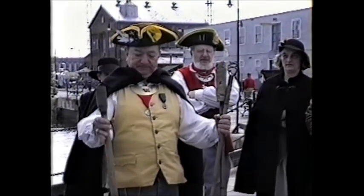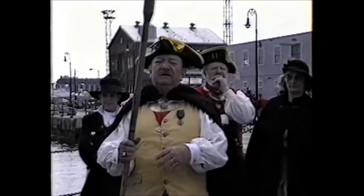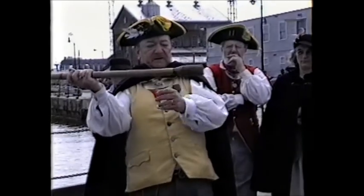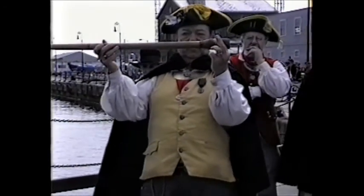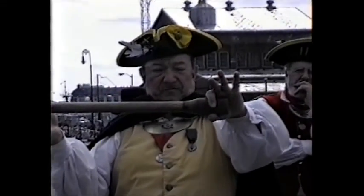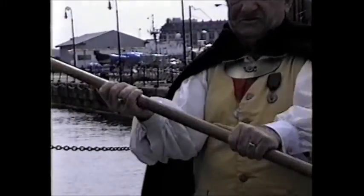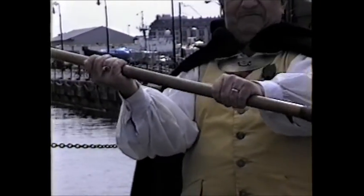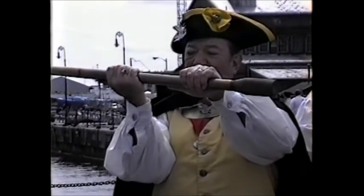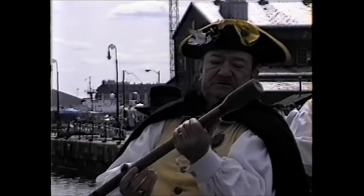Goodbye. Okay. As I mentioned earlier, Bill, will you hold those two things? As I mentioned earlier, a ram should have a fillet on it such that it's tapered from the ram to the shaft with a smooth taper so that your hand can slide over it easily. Again, thumbs pointing down range, away from the barrel. If anything happens and that piece goes off, your hands will fly open. You lose skin, but you won't lose digits.